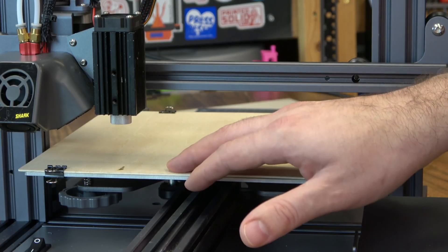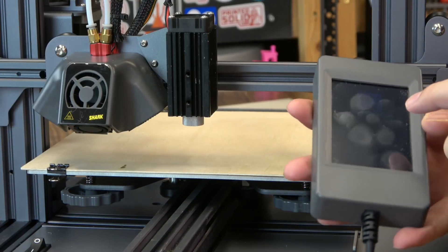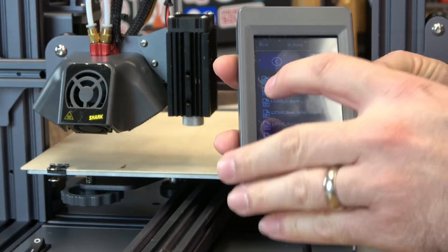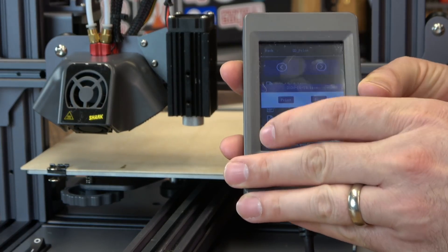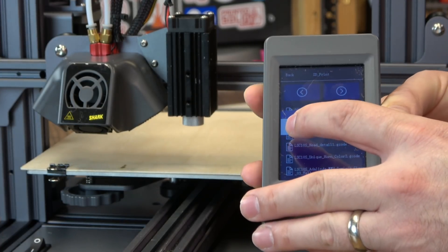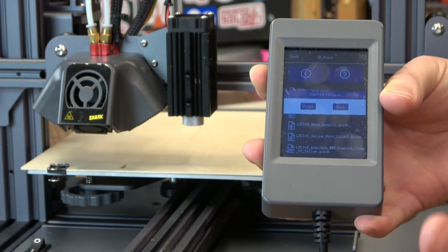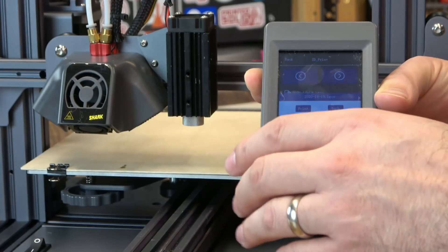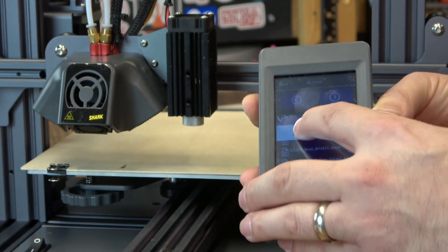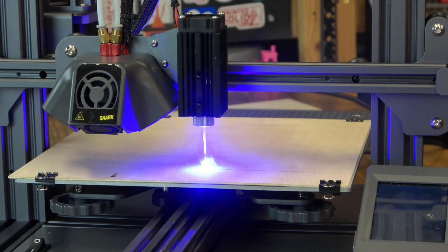The smaller the dot, the better it's going to engrave. After I brought the laser down quite a bit, I turned it back on and now it's a much finer point — it's going to engrave a lot more accurately. After you're happy with your test you shouldn't have to readjust the Z much. You'll have to change this with different heights of material, so definitely test on a scrap piece first. Now that the laser is focused, just go to print, select the G-code made in the slicer, hit print, and it'll home and start the laser job based on the software settings.